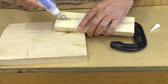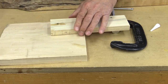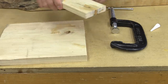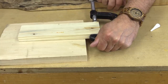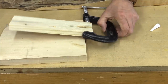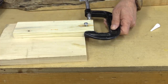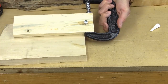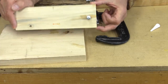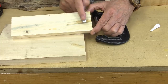Don't pull that screw out until you've got a good amount of glue in there. Now I'm going to let that screw come out and I'm also going to take a minute and stabilize this — it's a pretty nasty crack — but I'm hoping that if I put a clamp on that and allow it to come together and put that screw back in, hopefully it holds. Now when I release that clamp, hopefully that glue is going to hold it. That was a pretty big crack for that glue to hold on to, but look — even that little bit of glue has already held that crack steady. So that's one real quick way of fixing a crack from a screw or a nail.